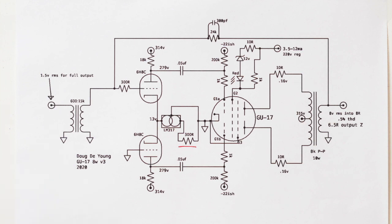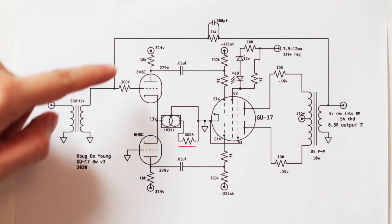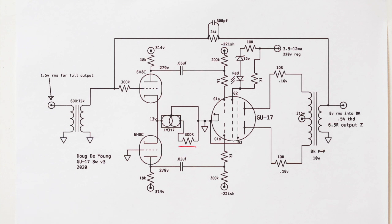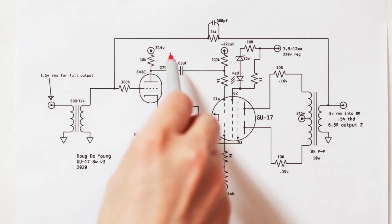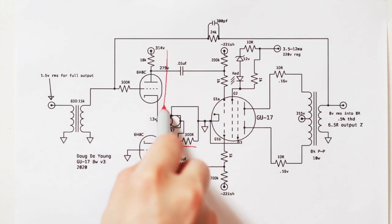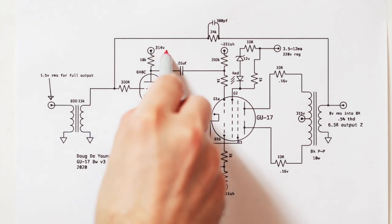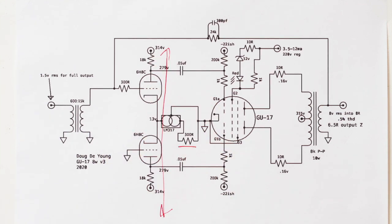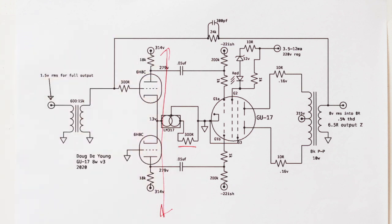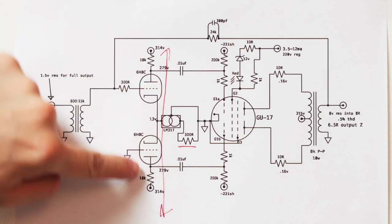Current sources are very, very high impedance in the realm of AC signal. And so with a current source, all of the AC of a differential stage travels up and down. I could draw it like so: the DC goes this way, right? The AC is all like this, right? Like that. And so the cool thing about that is that you end up with equal and opposite phase split because you know that all of your AC current is going to be flowing through both of your resistors.